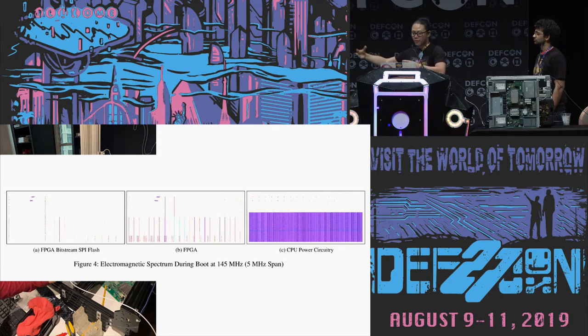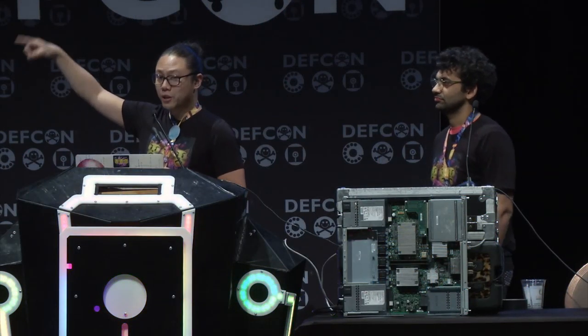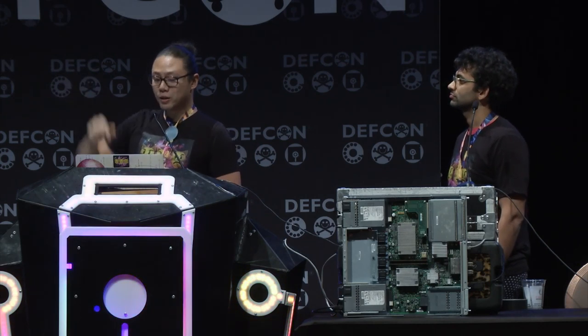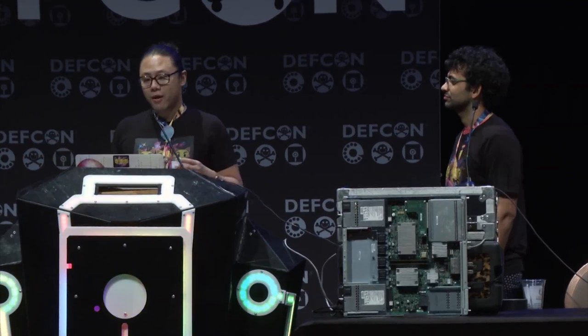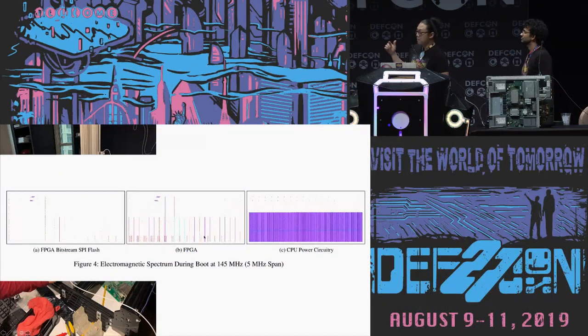So, this is like Blue's Clues, right? You put all these clues together, I wonder what's happening. So power turns on, the FPGA reads from the SPI flash its bitstream. It actually reads two bitstreams, and then it loads that configuration into the FPGA, and then the FPGA does some magical thing. And then basically at the very bottom of this, this is where the Xeon processor starts to do stuff. So we start hypothesizing that this is basically the mean little deity that's hiding in the machine that's taking our dreams away after 100 seconds.